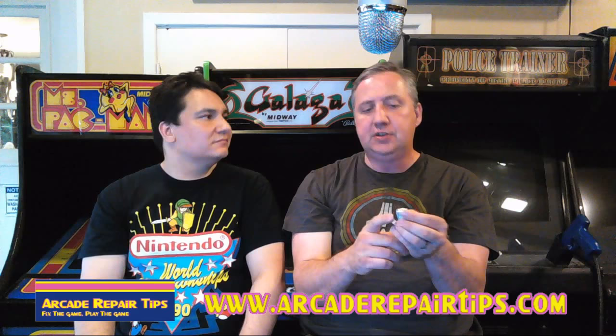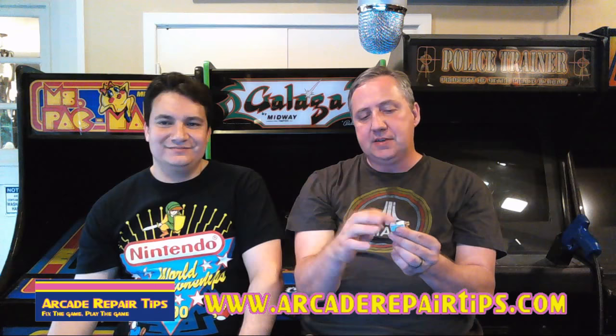But anyway, most of the time, you've got two wires, three places. Which ones do you use? Well, you're always going to use the common, and that's the one that is like in Sesame Street, the one that doesn't look like the others. He kind of plays by himself down here at the bottom. Then the one closest to it is your normally open, and that's how you test your switch. And they do go bad, so don't always think that it's a wiring issue. First thing I do is test the switch with my meter to make sure that's what it is.